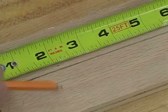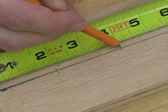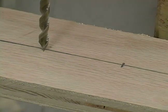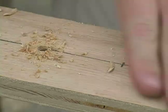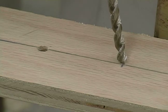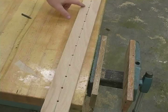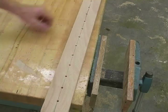Next we are going to put a mark every 2 inches to signify where each hole is going to go. After that we need to drill a hole on each of those marks. This is going to go all the way through. When finished, we'll have all of our holes drilled precisely at where each shelf could potentially go.